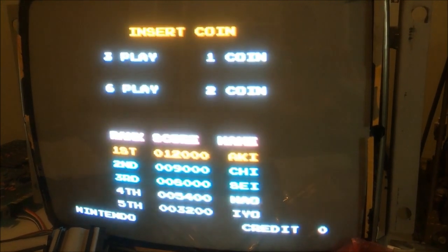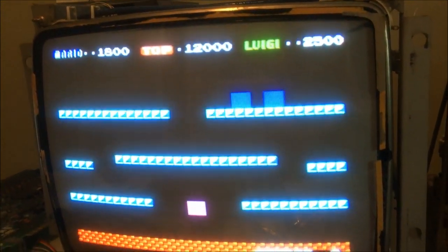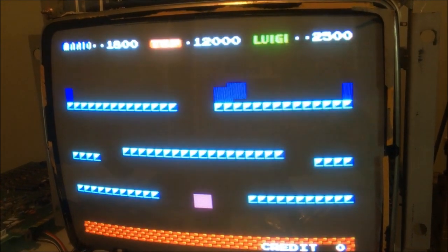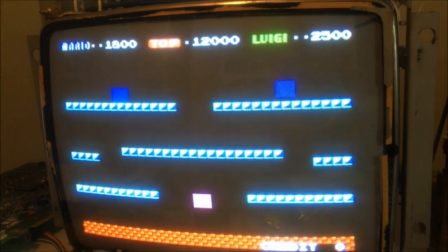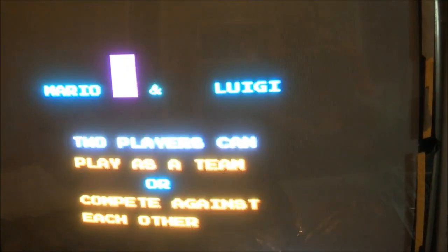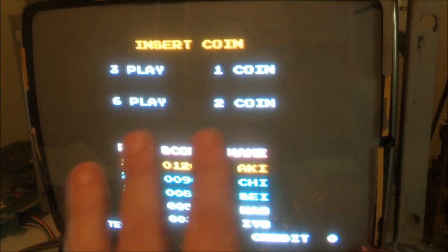I'm going to suspect ECL first. I'm going to go over the ECL, check out the signals, and make sure they're looking like they should. This is what it looks like with no sprite ROM data — looks pretty bare, but there's still that sparkle right there. I don't think that's character related, even though all this is character right here.